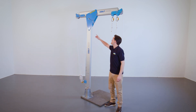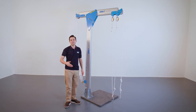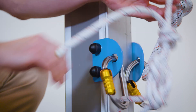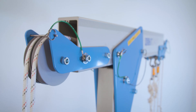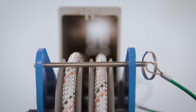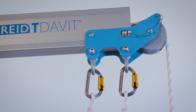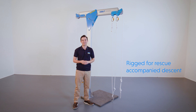In between the cheek plates is an EN 795 anchor point for attachment of one person for fall arrest. This facilitates transition to the shackle head or provides an elevated anchor point for a second person. The rear of the column has two independent anchor points for attachment of the working and safety lines, which can be rigged for remote operated rescue. The ropes then feed through the sheaves at the rear of the davit, through the beam and then through double sheaves at the front of the davit. Pins prevent the ropes from coming off the sheaves after the product is set up. The davit head also has two independent anchor points for attachment of the working and safety lines, which can be rigged for rescue-accompanied descent if required.